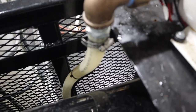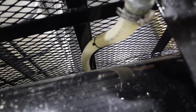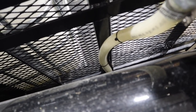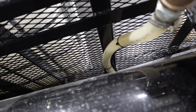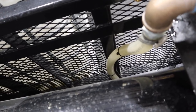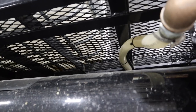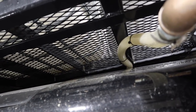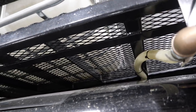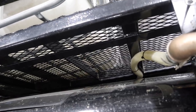I've got it hooked up to a one inch reinforced vinyl tube that goes all the way to the back of the truck, down behind the headboard, and then follows the frame all the way to the rear where it hooks directly into the reel. It used to be that I would have an array of PVC pipe and elbows, but I've learned that causes a lot of extra restriction — every time you put an elbow or a fitting in a pipe it causes more restriction. This vinyl tube going all the way to the rear definitely gives us a lot better flow than one inch PVC going through an array of fittings and elbows.